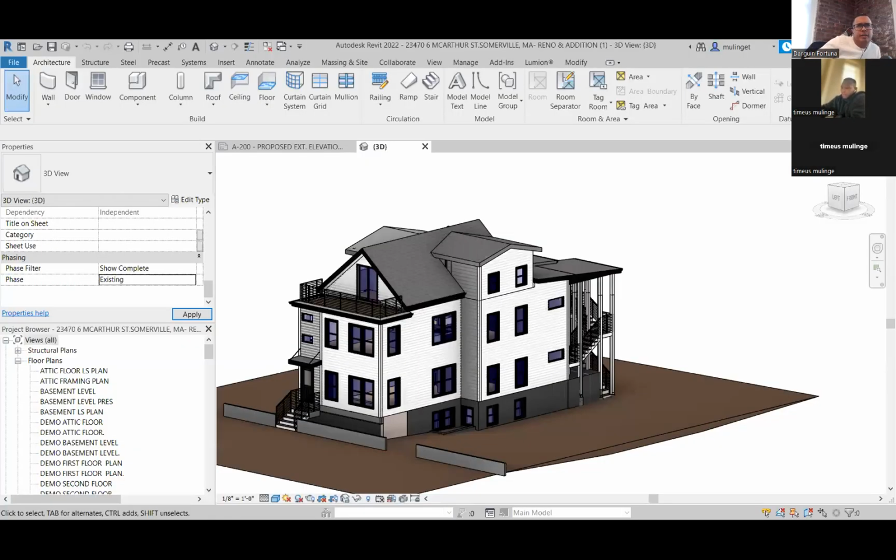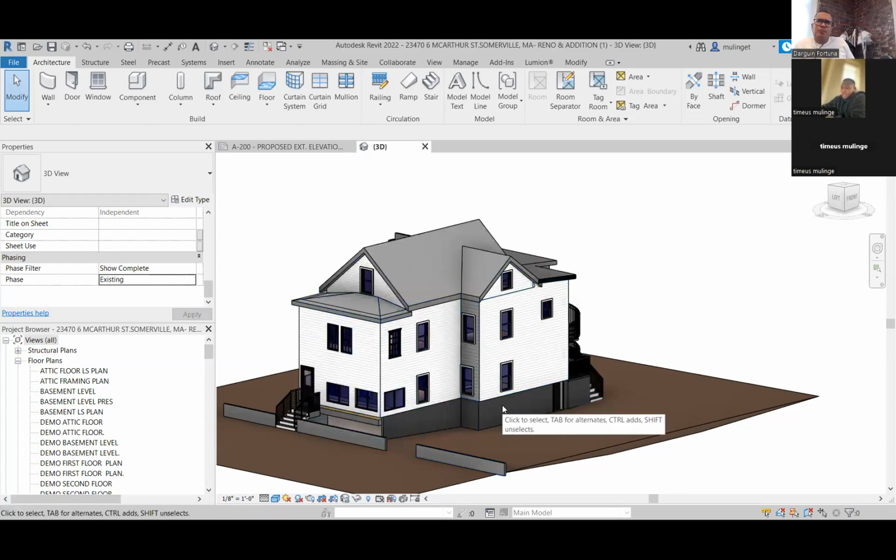So you have a challenge with this. Go ahead, tell me about it. The existing building had an exterior front deck that was later enclosed, right? So technically, this was the exterior wall initially, and the loads were being transferred down to the basement, the foundation, before it was enclosed. After it was enclosed, they made openings inside the house, but then maintained certain beams and columns within this front location.